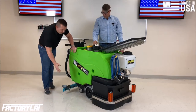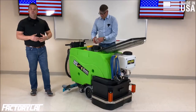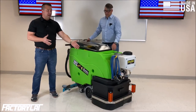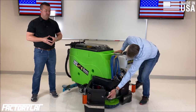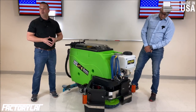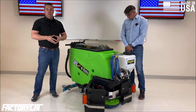Additionally, this package comes standard with urethane blades. This machine generates onboard aqueous ozone, which is spit out directly on the scrub deck for a maximum concentration of over 2.0 parts per million. Aqueous ozone is a proven disinfectant and sanitizer, and also a powerful oxidizer, which is why we have the urethane blades — because they're the most chemical resistant.